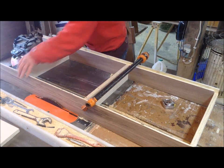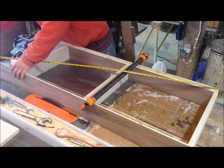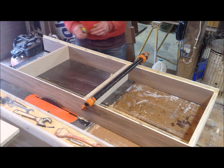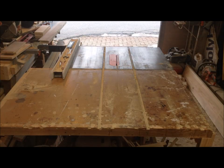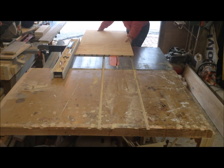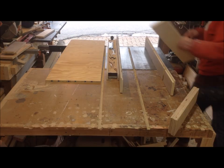There will also be adjustable shelves, and I cut a half inch rabbet on the back for a backer. Then I cut out plywood slabs for the three shelves - those are only four inches wide. This ended up being about 18 inches wide, so those were with the thickness of the dado, probably like 17 and a half.